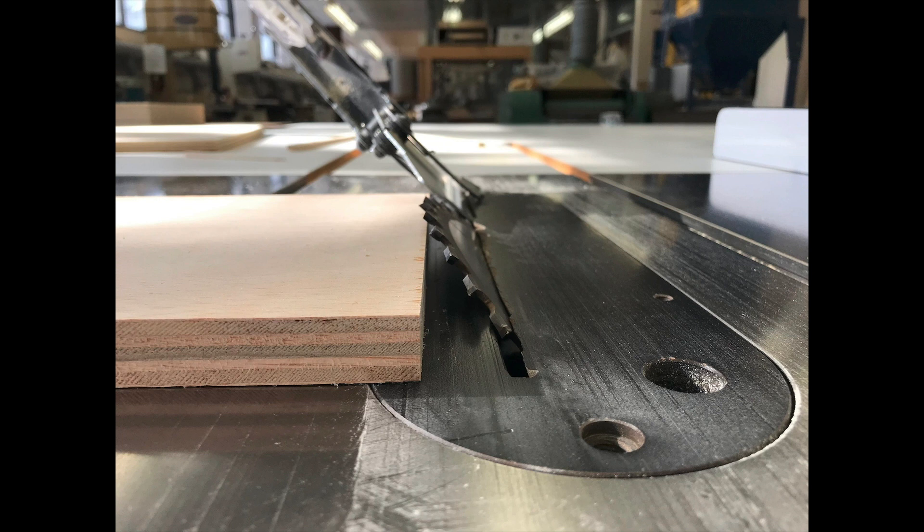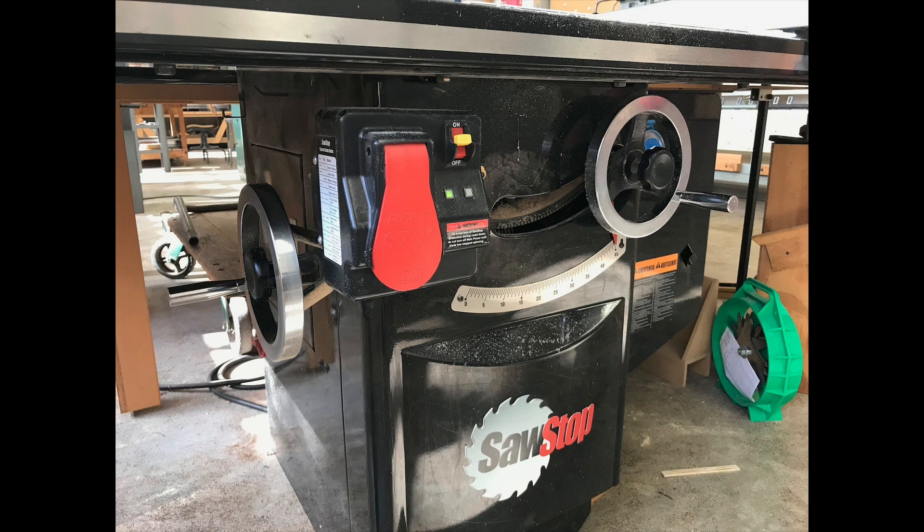Now to do the miter cut, you see that I rotated the blade 45 degrees. The board is 0.7 inches thick. The upper surface is actually the inside, the lower surface is the outside of the board. So I need to move the white guard on the right side by the thickness of the material towards the blade. There you can see the angle. The wheel on the left does the rotation, and the wheel on the right adjusts the height of the blade.